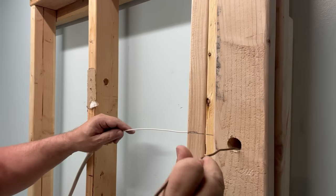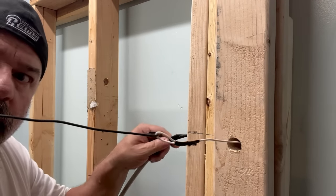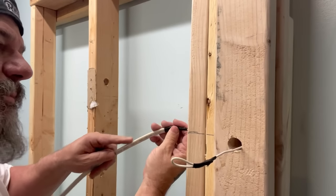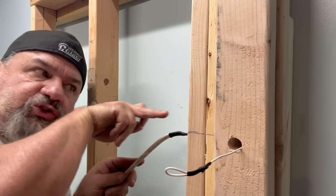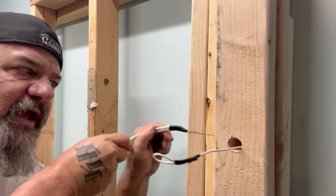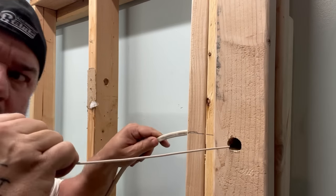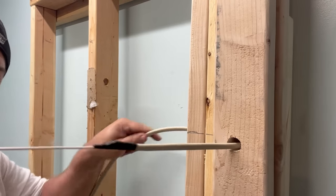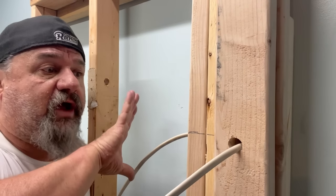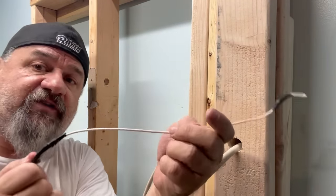I can see that eye, and I'm pushing it just like we did before to get it to bend. We've got that — beautiful. We still put that little bend in there, because otherwise it goes straight into the wood and the other wires grab and you'll never get it around that 90. Put a subtle bend in it, then pull and push at the same time with a little more pressure. And look at that — that works the same way for as many studs as you have on either side, whether it's four or five studs. It works the same way. There's your quick and easy fishing-around-the-corner hack.